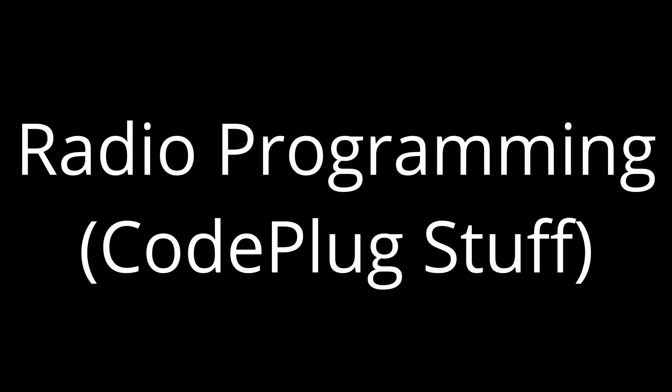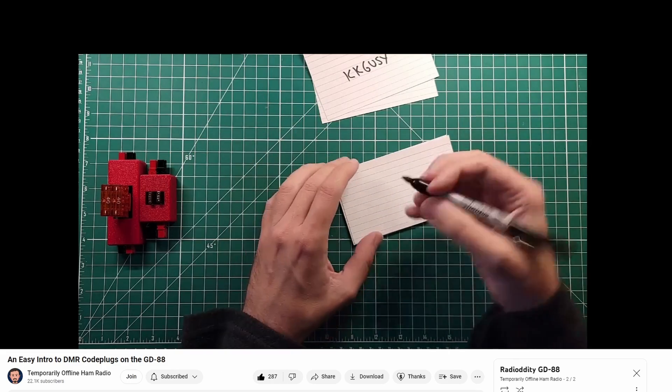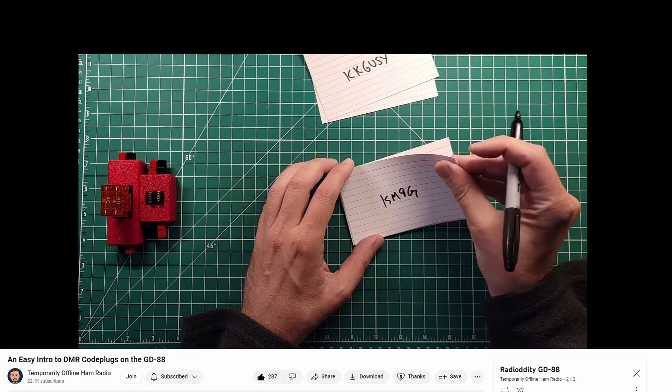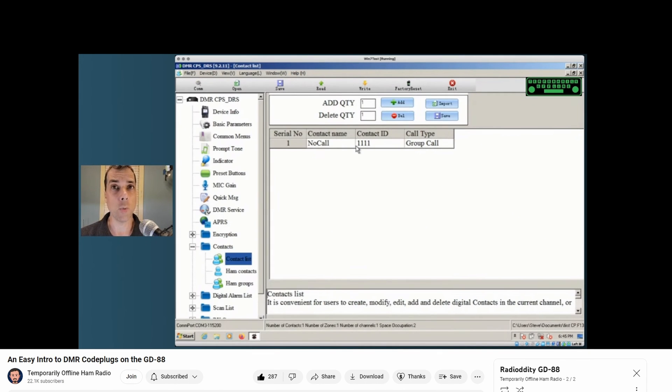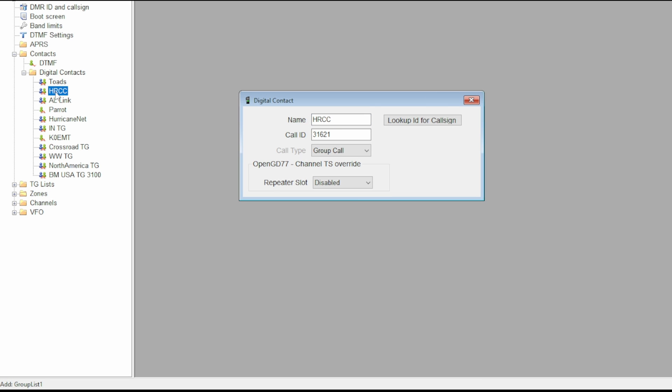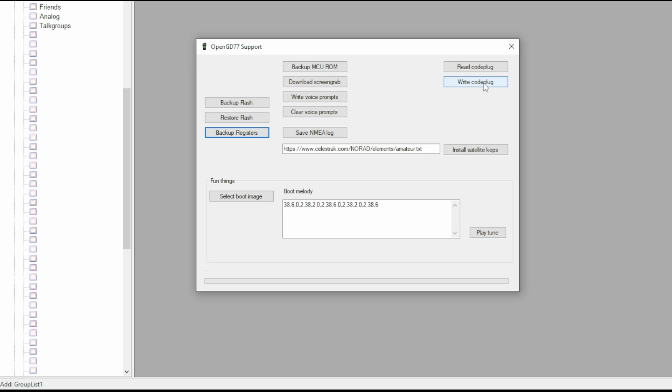Now with the hotspot sorted out, it was time to program the radio so we could give it a test. This is another video that's not for the same exact radio as mine, but the concepts were great in this one — and this is another one from Steve KM9G. I really liked the way he goes through things with the cards and how he explains it. I'll put a link to this in the description. As we look at his software, it wasn't exactly like mine, but the concepts were pretty much the same, and I was able to apply them to the OpenGD77 code plug software. I'm just going to show you as I walk through some of the contacts and zone stuff I put into my code plug. Looks different from the example before, but it works okay. I may have something not optimal done here, but this is enough to get me started to listen in and to try out the parrot thing, which is like an echo test. I'll push the code to the radio and we'll try an echo test on the parrot talk group.